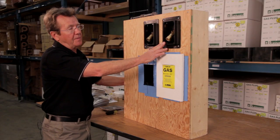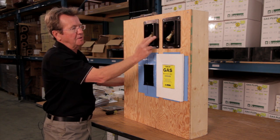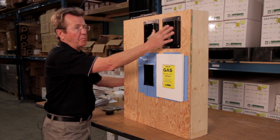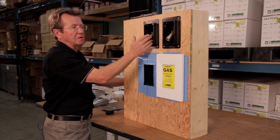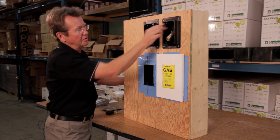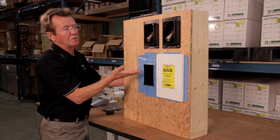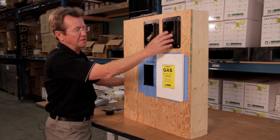On the back side there are two ways of entering the box — from the back and from the top. You can use either one if you're piping from the box to the main. If you're piping from the main to the box, I would recommend coming in from the top — there's one less fitting to turn, it's easier to fit in the box, and it's just more desirable. You'll struggle if you come in from the back when piping from the main.